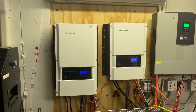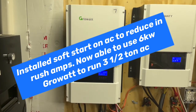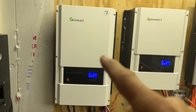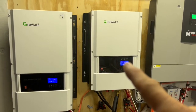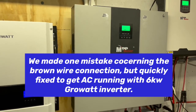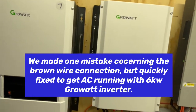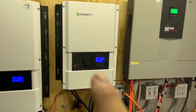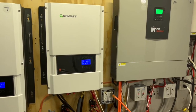The reason we're installing this SureStart or SoftStart is because we can start our 3.5 and 4-ton on this 12-kilowatt GrowWatt low-frequency off-grid inverter. We can't start either one of them on the 6-kilowatt GrowWatt low-frequency off-grid or on this MPP 5000-watt dual voltage. These are all dual voltage so you can run 120 or 240. We're hoping that once we put the SureStart in, we'll be able to start it with those smaller units.